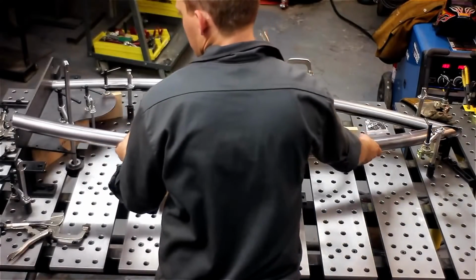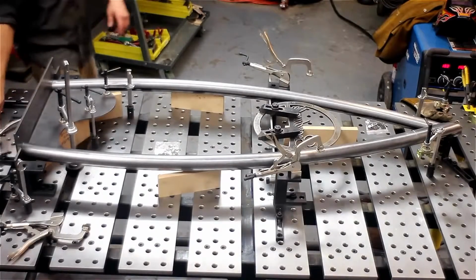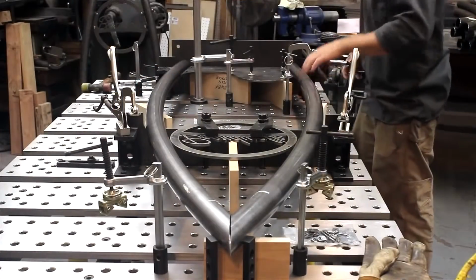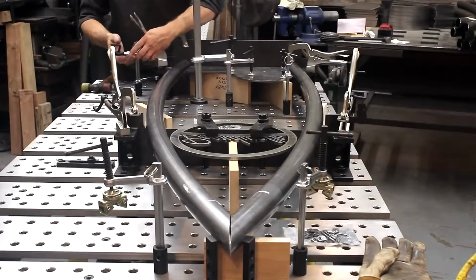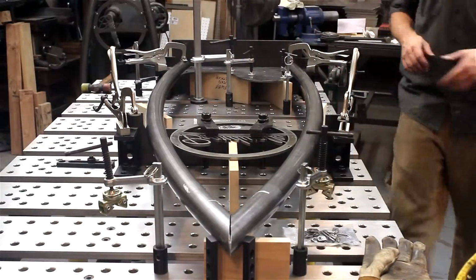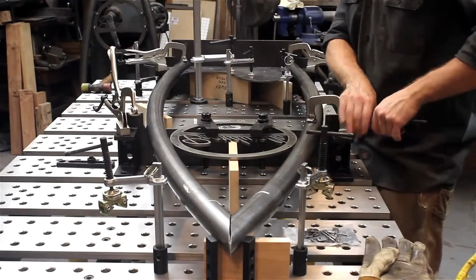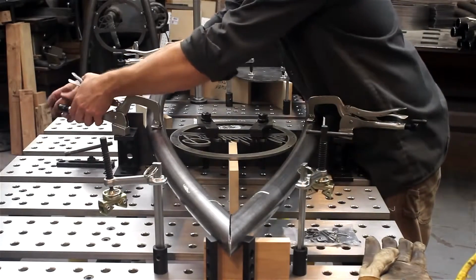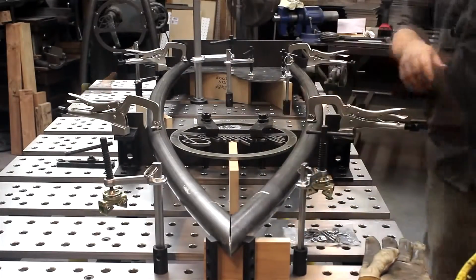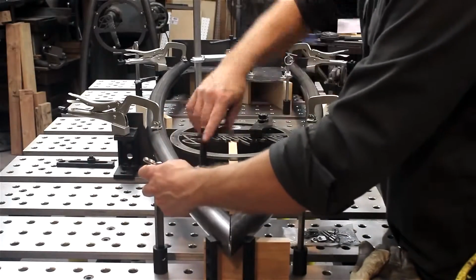The welding order is pretty important on a piece with curved tubing. I would do 4 or 5 tacks for the base of the tubing to the base plate, and then at the peak I would do 3 or 4 tacks about 2.5 inches of the seam at the inside of that joint where I'd finish weld, so that most of the distortion would happen while I was set up in the fixture. Then I would weld the tabs to the tubing, which later would be used to mount that circular component to the frame. The reason that's important is if you have distortion after you've welded those tabs in, then your hole centers don't line up well anymore.